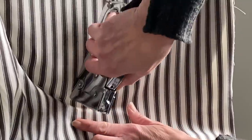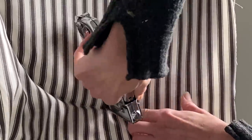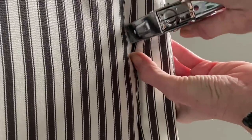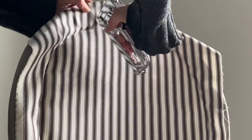So whether it's the back or the seat, what I found super helpful is to actually place the fabric exactly where I wanted it, and then apply a staple in all four sides first, then work your way around. This will also help being able to pull your material nice and evenly, even working on a circular area, or even if there's curves in the seating. So again, this will keep the fabric nice and straight.